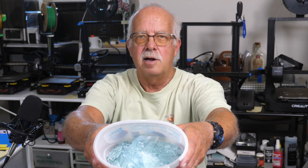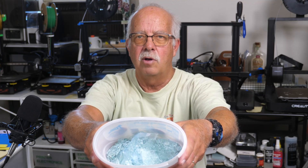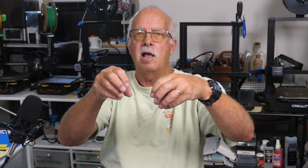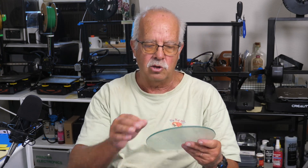If your speed is too slow or your power is too high, you'll end up with what I call redneck diamonds. One thing with tempered glass is when it breaks inside the laser enclosure, it doesn't just turn into some little pieces — it literally blows up. You'll have glass everywhere and it makes a mess. So you definitely need to keep your speed high and your power low, but you still want to get a good etch.